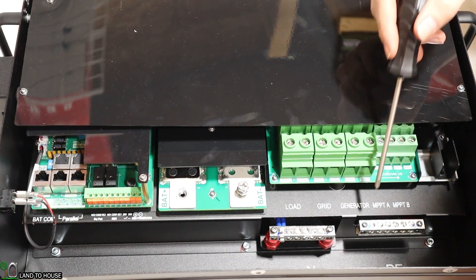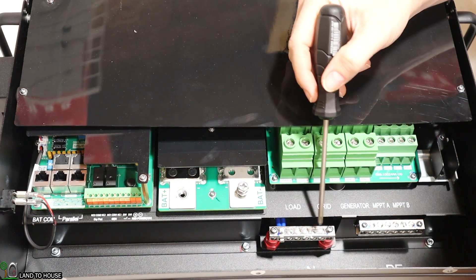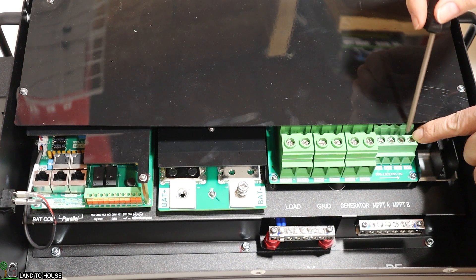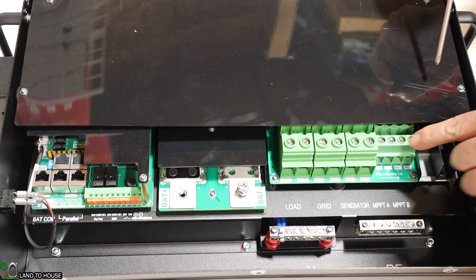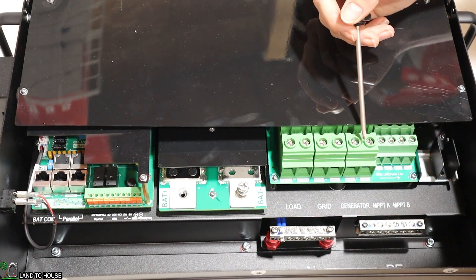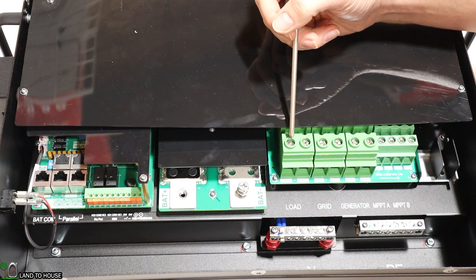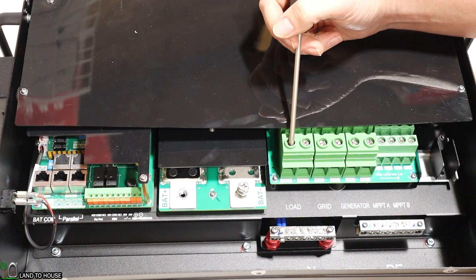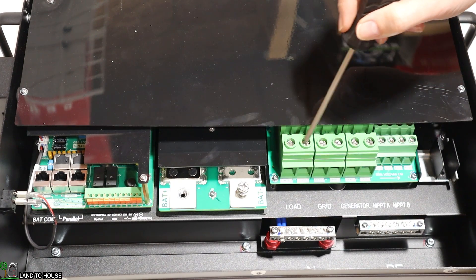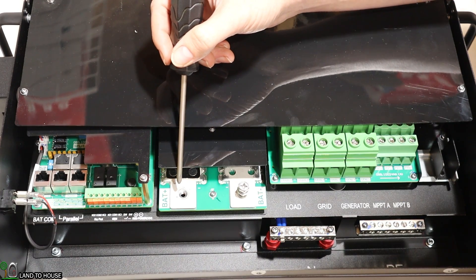Let's take a look at all of our connection points. Starting on this side is the PE or earth ground — that bus bar will have all your grounds. Over here is the neutral; all of your white wires will go to that. Over here we've got the solar input: PV1 positive, PV1 negative, PV2 positive, and PV2 negative. Those each have a 25-amp input and can do 480 volts input. This one here is your generator input — gen line 1 and gen line 2. Over here is the grid: grid 1 and grid 2. And over here is your load output — Load 1 and Load 2. In my install, I'll be using PV1 input, earth ground, neutral, and the load. I won't be using the grid or the generator.